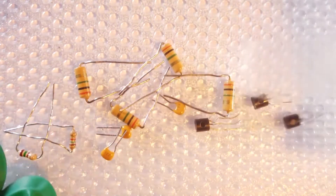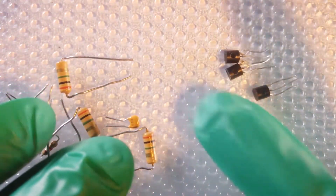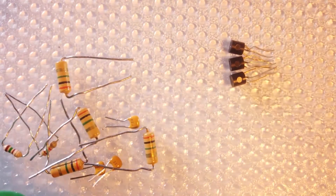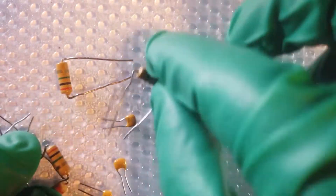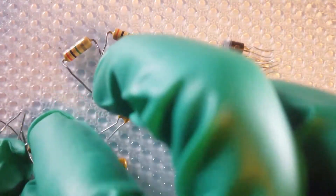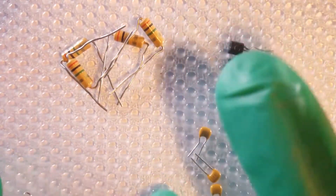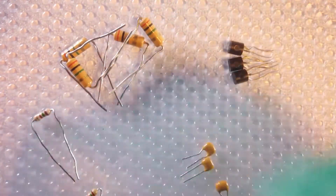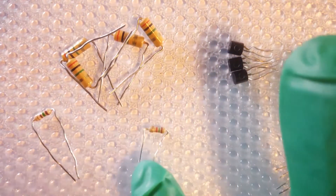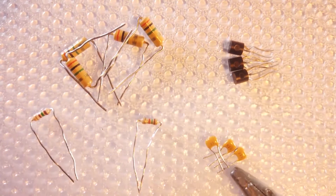Let's go through all the elements we are going to use for the preamp. We have three FET transistors — FET stands for Field Effect Transistor — with reference 2N3819. We have four 3MΩ resistors, one 150Ω resistor, another resistor of 1.5KΩ, and three film capacitors of 220pF at 50V or greater rating.